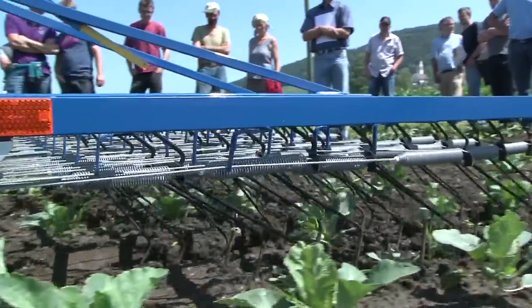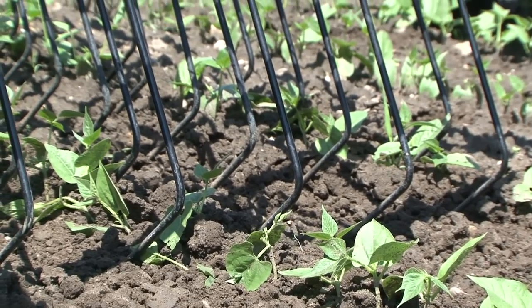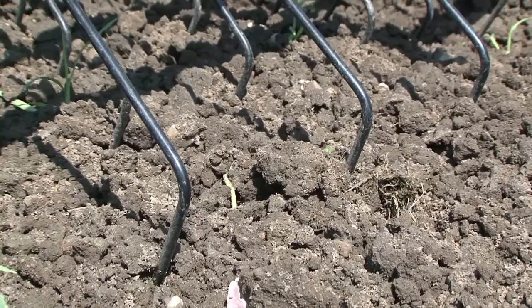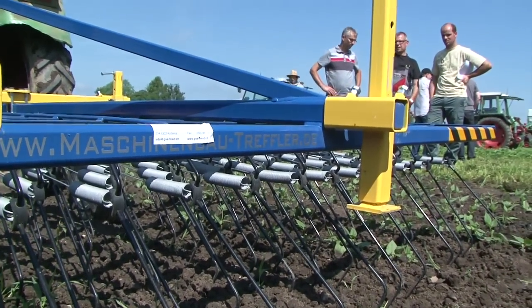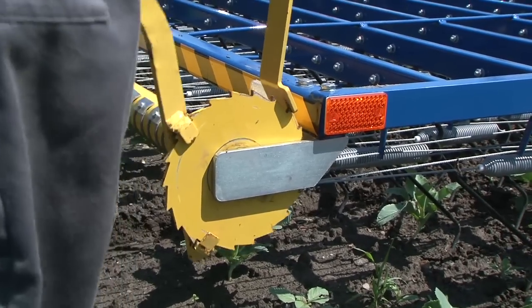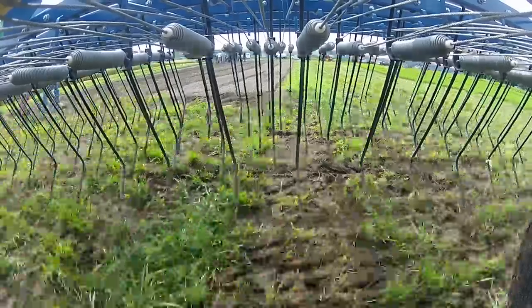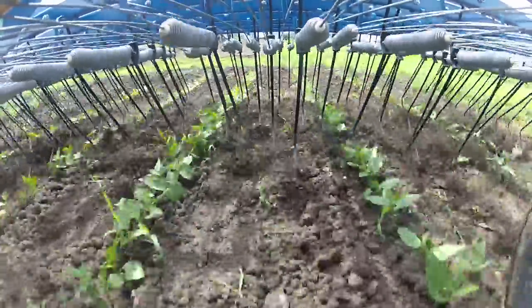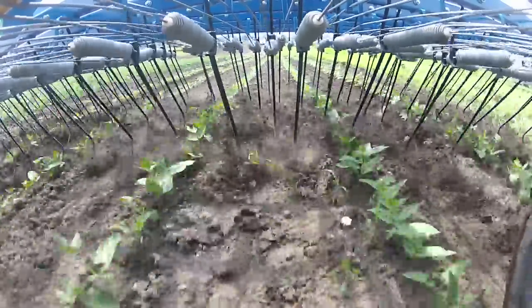Standard harrow technology has been upgraded with the Treffler Precision Flex Tine Harrow. The 500 mm long and 8 mm thick tines are fixed to tension springs. The 90-degree angle tine tips penetrate the soil surface in a relatively shallow manner. Neither the soil nor the crop is damaged; weeds are uprooted and pushed up with the soil, ending up on top because they are lighter. The tension springs and bearing pressure of all tines can be centrally controlled hydraulically or mechanically. In raised beds, tines under greater pressure uproot weeds while crop plants on the bed are gently cultivated with a maximum working depth of 2 cm.